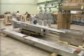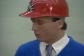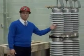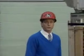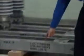Now we'll move back on location to show the assembly steps. A typical Model 2010 consists of 3 skids: one containing the mounting pedestals and other components, one containing the operator, and one containing the pole units. Because each circuit switcher is completely assembled, adjusted, and tested at the factory, it is very important that components from different circuit switchers not be intermixed. It's easy to avoid such intermixing since the serial number for each circuit switcher is prominently stenciled on each major component.